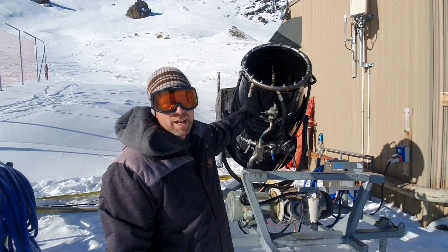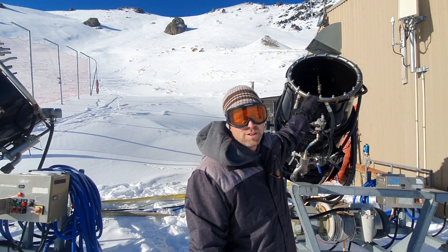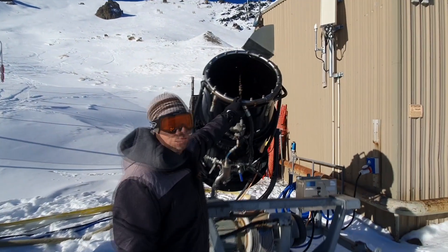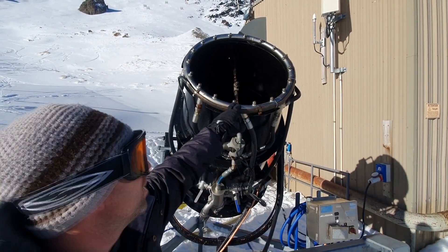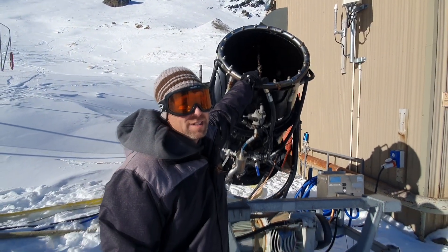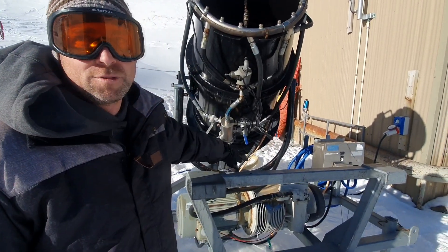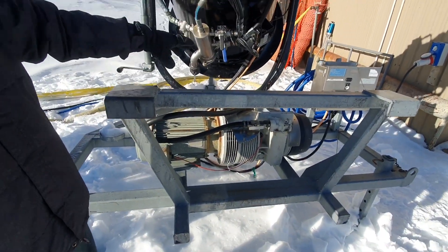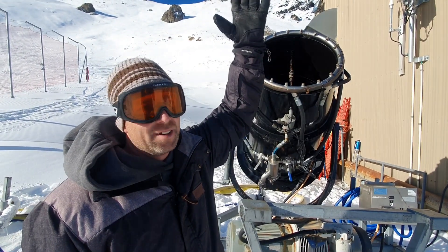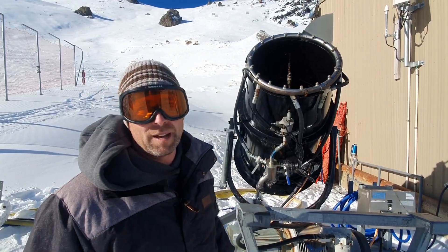This here is a classic polecat — a snow machine that's been around for decades now. Probably one of the more reliable ones, although the technology in it is getting pretty old. These nozzles here are all your classic high pressure water nozzles, and that central one is the nucleator nozzle. The central one is the compressed air-water mix, whereas these ones are just straight water. Down at the bottom you've got your compressor, all connected up, and at the back it's also got a fan to give it elevation when it throws the snow out. That's a brief look at old school technology — a brilliant example of what we've had for snow making for the last 20 or 30 years.